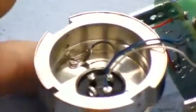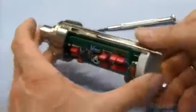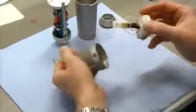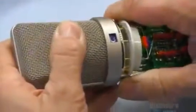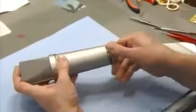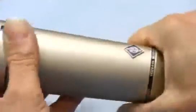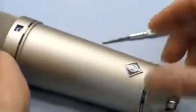A technician then wires the brass support piece that we saw being made earlier to the electronics system, and then he secures it with screws. After installing switches, he inserts the microphone capsules in the grill. He screws the capsule assembly to the grill and joins it to the electronics. He slides the metal casing over the electronics and secures the microphone with a big screw cap. He checks the switch that changes the directionality of the mic, and now it's ready for a sound check.